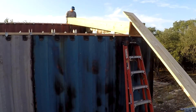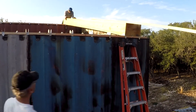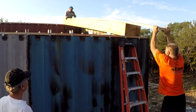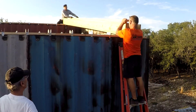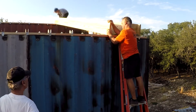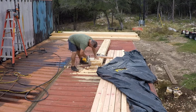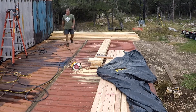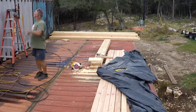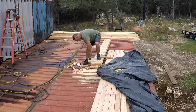Once we got the first two rafters on, we just kept moving and did four that day. It was a rinse-and-repeat process. The wedges I cut off from the top and bottom of the top plates from the rafter I use as templates for the other ones — fairly easy. Here I'm doing the relief cuts for the 2x4 kickout that's going to be on the bottom side. I forgot to do that on the first two blocks but might fix that later on.